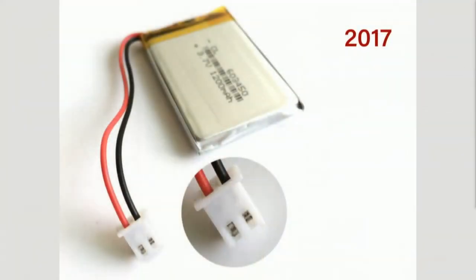So just a little bit about the design. This is way back in 2017 when I first started. One of the things to save weight, if you're trying to save weight on any kind of toy or commercial product, is where you put the battery charging. We've all seen things where the battery charger is off to the side, you have to buy a battery charger, potentially lose it, or you design it right into the board. I designed mine right into the board, but only because I really hate those JST connectors.